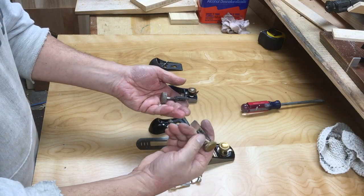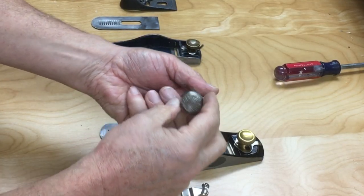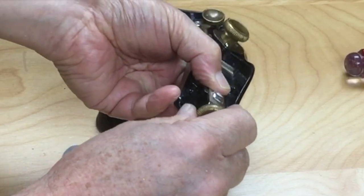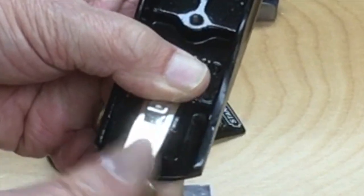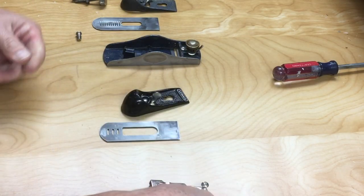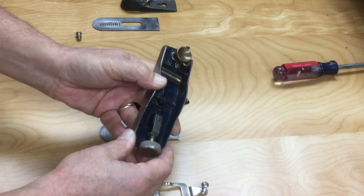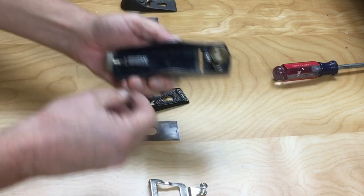Here are the two adjusting dials. The one on the left is the 60 and a half; the one on the right is for the new plane. You can see it's just an adjusting knob with a threaded guide. The piece of casting that this rides in is much larger in the new plane than in the older plane. It seems to slide very nicely in that little channel as you screw it in and out to make adjustments for the blade. The 60 and a half rides in a skinnier channel; however, I would say that the machining of the parts, as they glide together in that channel, felt a little nicer in the old 60 and a half.